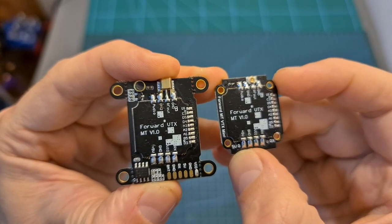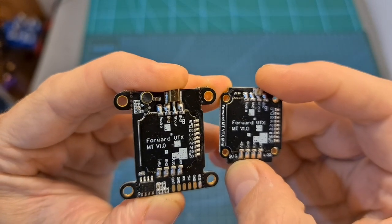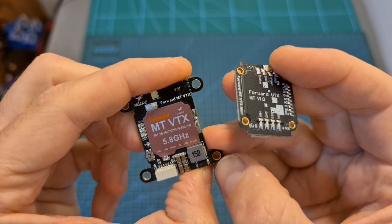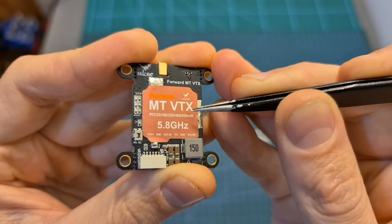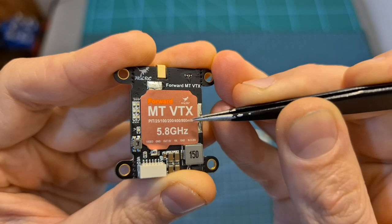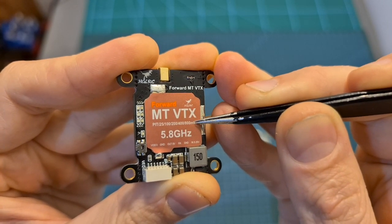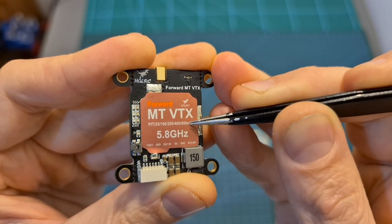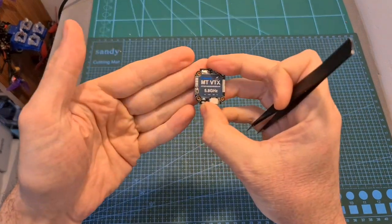differences between the two are the mounting pattern, the antenna connector, and that the full-sized version features a voltage regulator and an LC filter. Due to that reason, and also as you are about to see in the upcoming output strength test, I think that the 800 milliwatts value on the full-sized version is actually a mistake, and it's supposed to be 600 milliwatts, just like the mini-sized version.